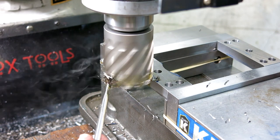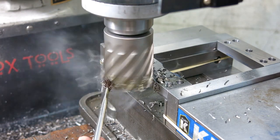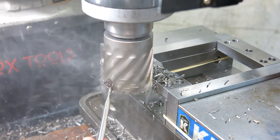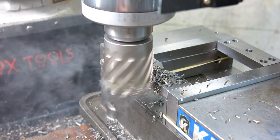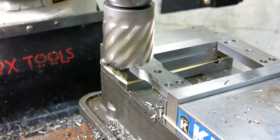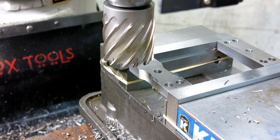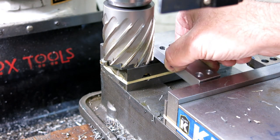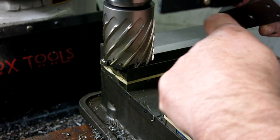I'm just hand feeding this — you can feed it with the power feed too. If you haven't tried these annular cutters, you'll find them for a reasonable price, so get a few because they're really nice for this kind of stuff. You may have noticed I have a second one over here, and that's just to stabilize the setup a little bit. Because we're clamping something skinny, make sure I don't trap any chips.